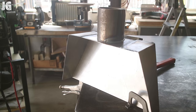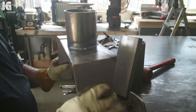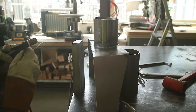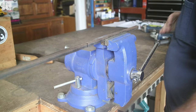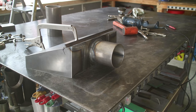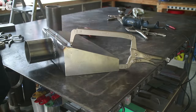Trying to get this thing propped up into a position where I could weld it comfortably became a problem. It's all these weird angles — I couldn't brace it into position to get it welded out. I struggled a little bit and had to get a piece of bar stock to rest my hand on while I finished up the weld, but ultimately we got it done. Once it was done, it kind of wanted to lift up a little bit when I put it flat on the table. So I got a piece of half-inch angle iron and put it across the bottom on the backside. One side was a little warped, so once I clamped that down and welded it up, it straightened things up really nice, sat flat, and propped itself up a little bit.